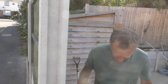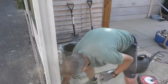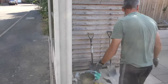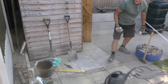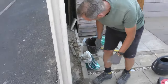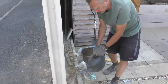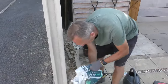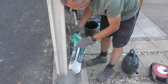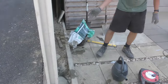That's going off quite nicely. If you want, you can put a couple of bits of rubble in to take up the bulk of the hole and save a little bit on your postcrete. We've got a few odd bits here — we'll chuck a couple in, add a bit more water, then finish it off with postcrete. You can then get a little trowel and just finish it to make it look a bit nicer.